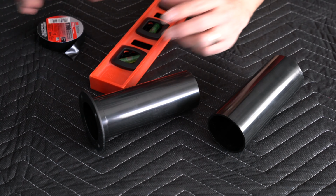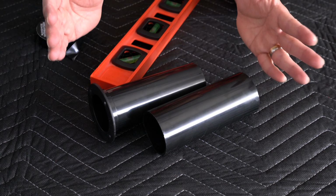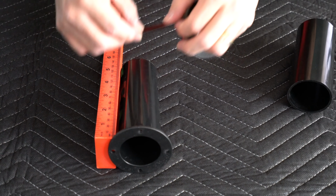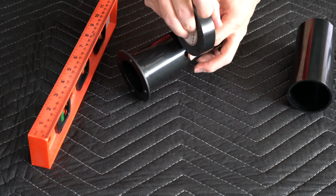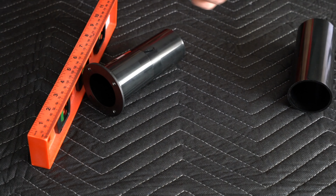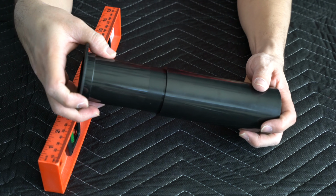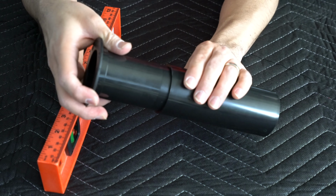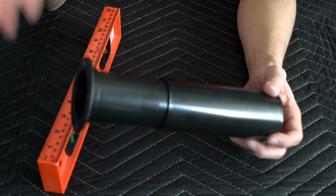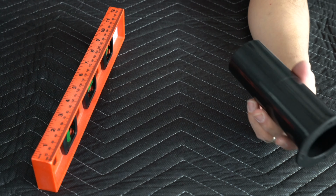According to CSS, you want to keep it 9 inches long inside the cabinet, the whole length of this bass tuning port. A little over 3 inches, or around 80 millimeters, is where I put the electric tape. This way I can adjust the position before I glue it or double tape it. When you slide it in, it will lock this outer tube right there, and then I can put the tape measure inside the cabinet and turn it to adjust the position. For now, let's mount this.